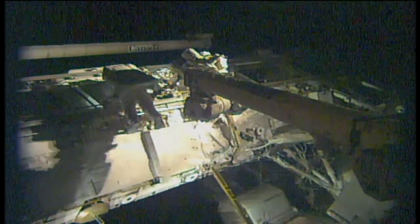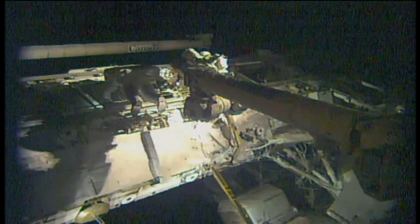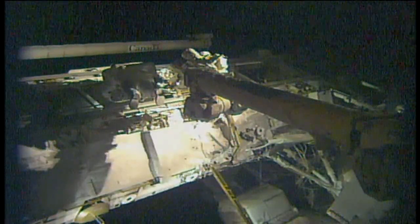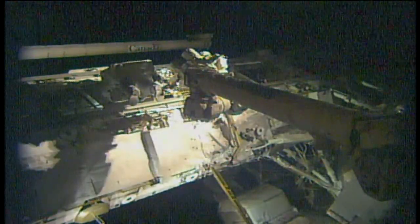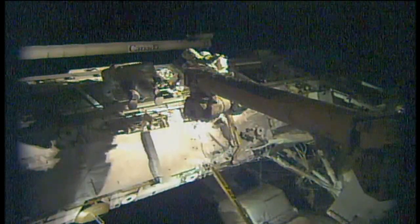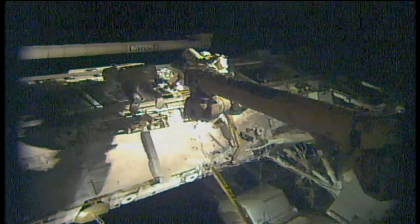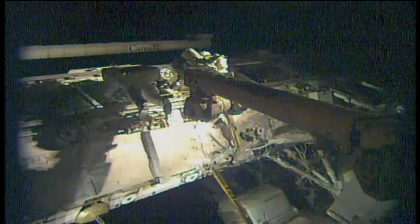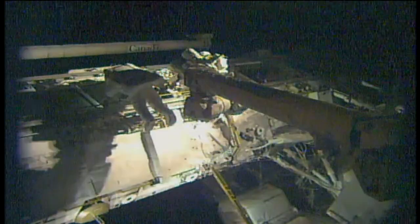You're looking at Joe Acaba along the starboard truss of the International Space Station, where he has installed a portable foot restraint. He'll resume his work momentarily — the reconfiguration of cables to a D-MADE, a pan and tilt unit cable on the camera port three location on the lower outboard portion of the starboard truss, that will enable him to install an enhanced high definition camera at camera port three for future use.